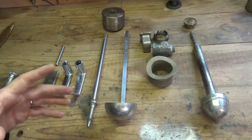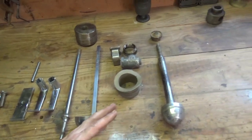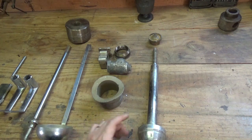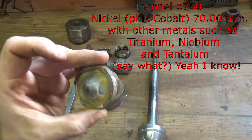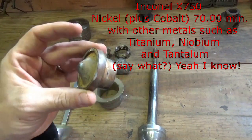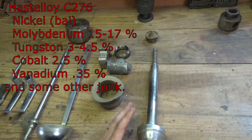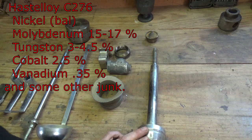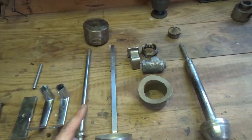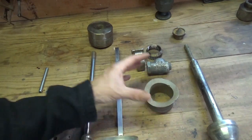You do want to know the difference between some alloys that are stainless-type based — really nickel-based alloys — which can bring you a lot more money, like Inconel X750, which can bring a few dollars a pound. Hastelloy C used to get $15 a pound because of the presence of so much molybdenum in it, along with cobalt and tungsten, which helps drive the price up. Some people say that 304 is a better stainless for heat uses than 316, but that's simply not true.